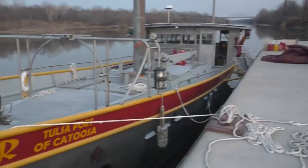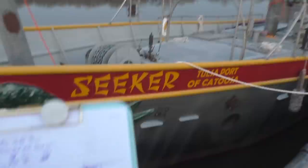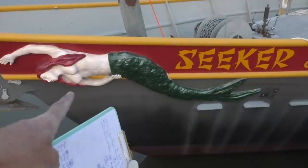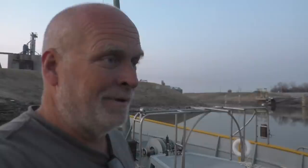She's better but she ain't there yet. We've got the trim taken care of as far as the list - in fact we built it back the other direction by putting that lead in these fuel tanks over here. We still have all those battens laying on this side of the boat, and we moved some things around in the cargo hold. But it's the pitch that's still bad - we got 18 inches of paint showing there, which means we can push this down another 10-11 inches. We put about 1,100 pounds up here just beside the mast and inside of the mast, then threw all the other chain in there. It didn't bring the rear up enough - that's our problem spot.